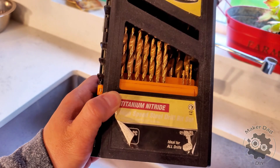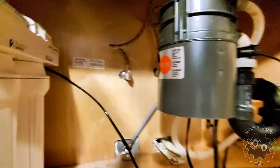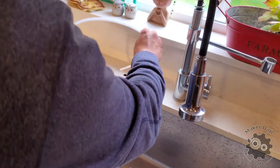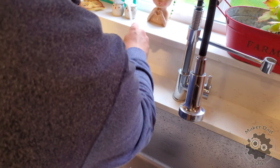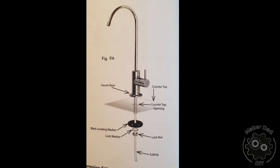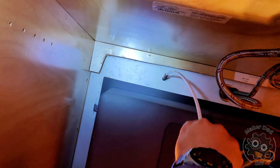Make sure you wear a respirator during the process — the dust can be pretty nasty. Depending on the material of your countertop, you may want to choose a carbide drill bit. In my case I used a steel spade drill bit; it took longer but was fine. One important step missed in the manual: check with your wife if she's okay with the location of the hole, otherwise there may be serious consequences. Once the hole is drilled, proceed to install the faucet. There is a faucet body and faucet base on top, and on the bottom a logo washer, lock washer, and lock nut — these two parts sandwich the countertop in between.